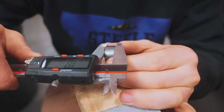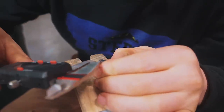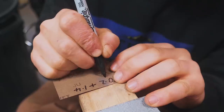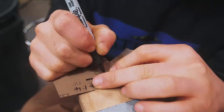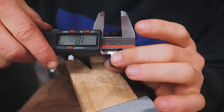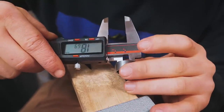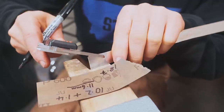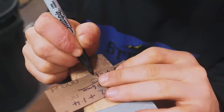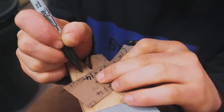I'm going to measure this width: 10.2 millimeters. I want about 0.7 millimeters on either side to roll over, which means I need an 11.6 millimeter wide strip. This is going to affect the inside diameter and make it smaller, but I think that's good because I made it awfully thin anyway. The inside diameter is 18.7 millimeters and this sheet is 0.5 millimeters. 18.7 take away one times 3.14 gives 55.60.